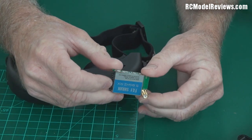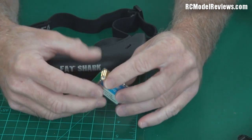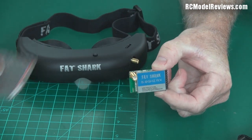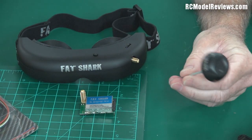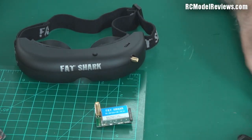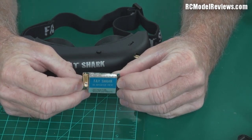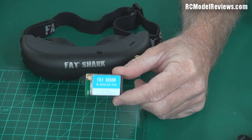One of the reasons I don't like the old Fatshark receivers is they're not very sensitive. Using the Foxtech SkyRF system at 5.8 GHz I could get two kilometers on 200 milliwatts with a nice set of homemade circular polarized antennas. When I use the Fatshark receivers with the 600 milliwatt Fatshark transmitter — three times the power — and the Fatshark antennas, I could only get 1.2 to 1.5 kilometers. So those receivers are way less sensitive than the SkyRF ones.